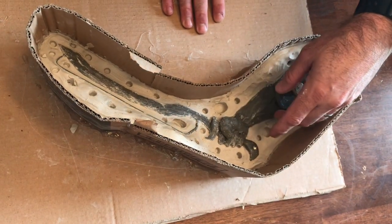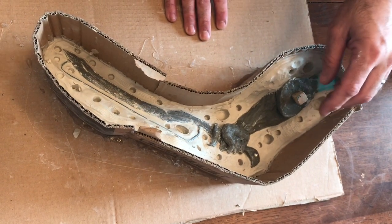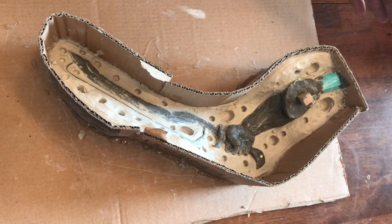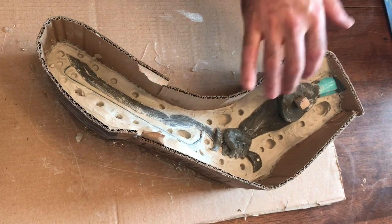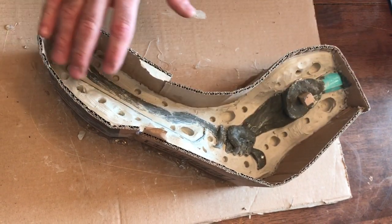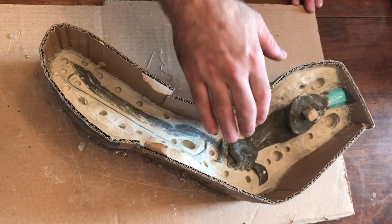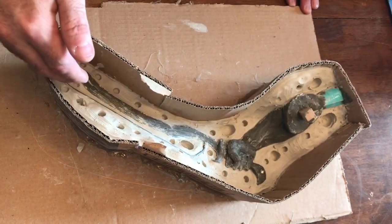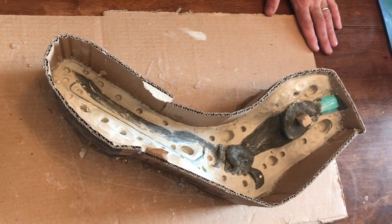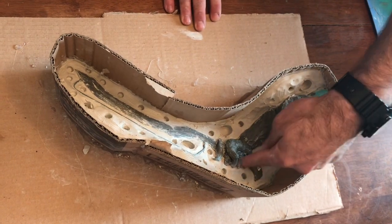My figure here is wax-based clay, so when it gets cold it gets hard and when it gets hot it melts. So when I have these figures that we cut off — which I showed you last time — it gets hard as a rock if you put it in the freezer for 10 or 15 minutes. Then take your wet clay and smash it down into the clay and it'll create a real nice crisp line. And then you go and clean up the edges real nice.